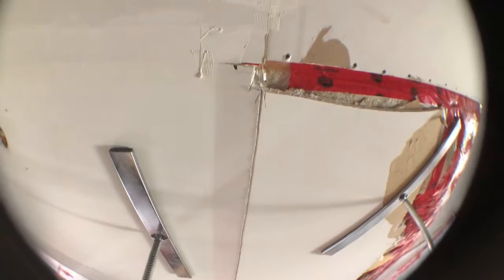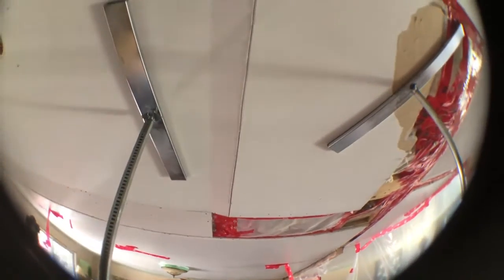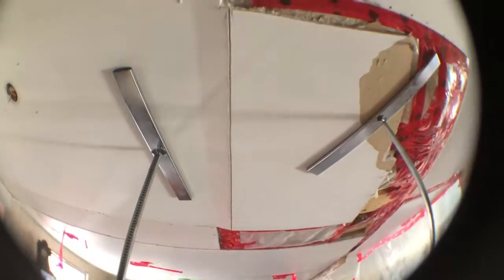The second thing that happened is, you see this little break right across here? Well, that's the drywall seam. So I should have known it was there, but usually the seams don't line up. I guess in this case they didn't really care. Usually it's all over the brick pattern and whatnot. You just do it alternating. So instead of going straight across, I'm gonna have to go this way, because you can't have 2 seams like that. This doesn't work. So at least my seams will line up.